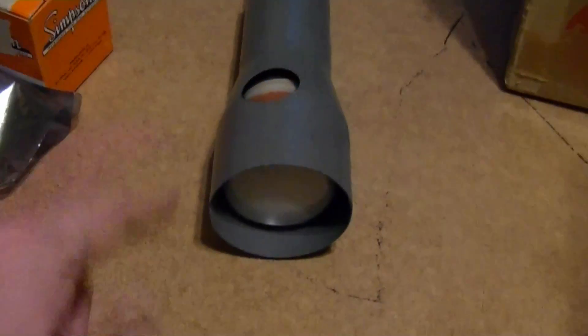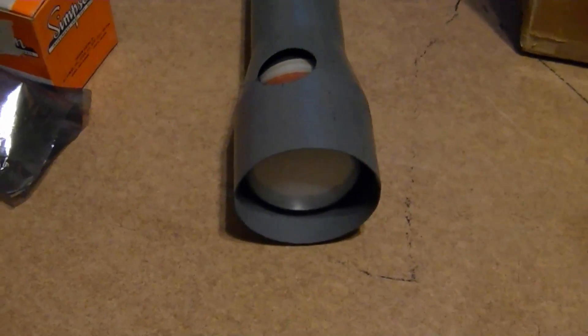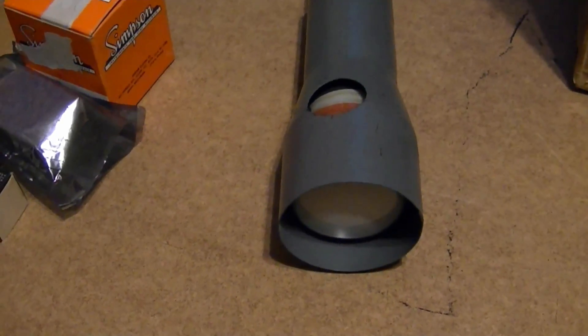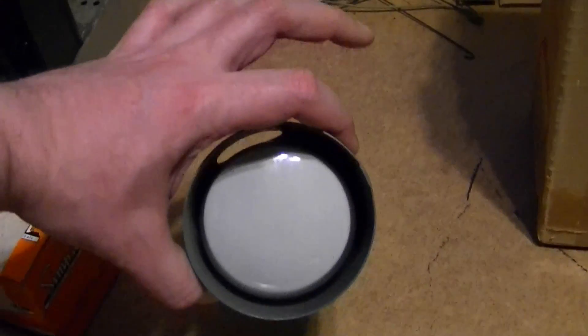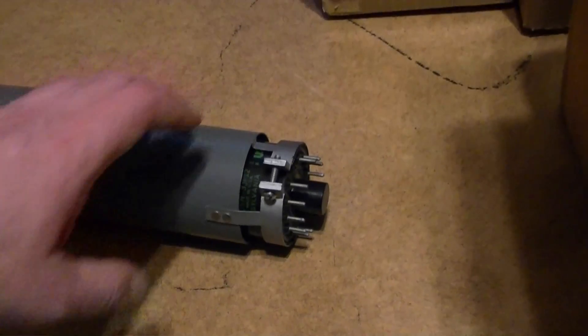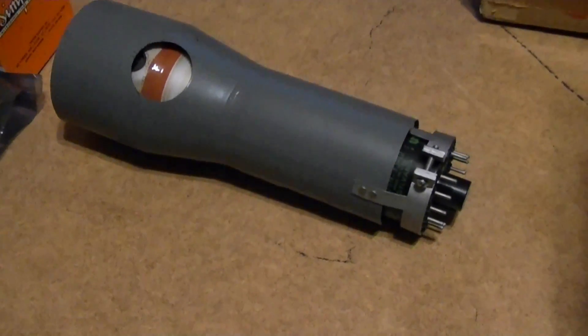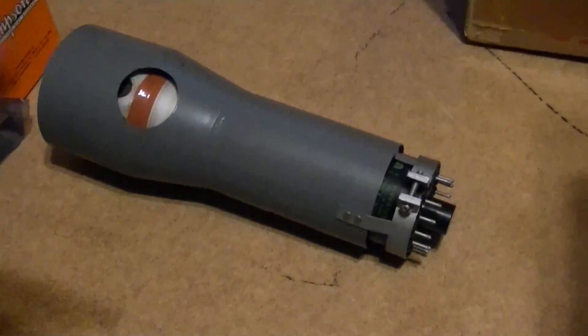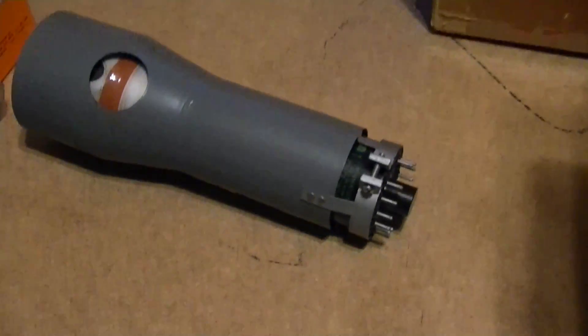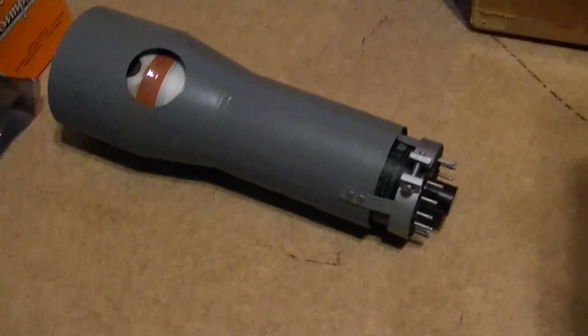It might have something more to do with the deflection design. It's just like a ring of conductive material up here. So there's an A1 accelerator down here, then an A2 around here, and this is the A3 accelerator. So why do I care about these? Well, these are different colored phosphors — that's orange. I'd mentioned these in a video a while back, last time I worked on a VT71, that I figured the pinout's basically the same — what would it take to hook one of these up to a VT71 TV and watch a little 3-inch orange TV on it?